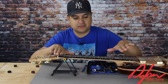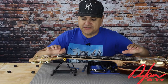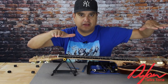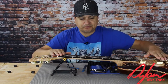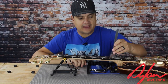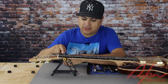Before we check that, we must check our neck relief — because if we have too much neck relief, we're pulling our strings even further down. You see how this all works together. Also, maybe our string height is too high at the saddle. Remember that when we set our nut height at 20 thousandths, if our saddle height isn't at a nominal two millimeters at the 14th fret — it's a straight edge — so if the saddle is way high and we set the nut at 20 thousandths, bringing the saddle down will also bring the nut height down a little, because the string is the same straight edge. What I like to do is take my gauge, go to the 12th fret, set it at two millimeters, then come over to the nut and check the string height all the way across.